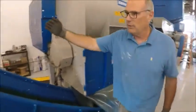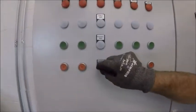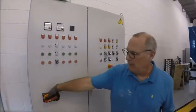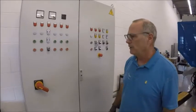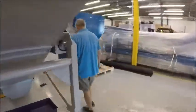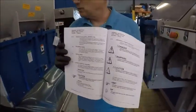Everything is set. We're walking over to our control panel. We turn screen hydraulics off. We turn maintenance mode off. The machine will now be ready to run in run mode once you do these procedures. And when you're all done, just go like this — it kills all the power to your unit. All in all, the ZSS shredders are very easy to maintain and clean, and all the procedures and torquing specs are in the manuals we provide. We also have all the safety procedures and warnings in these manuals, so prior to ever working on this machine, make sure you read the safety manuals.